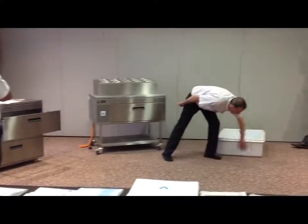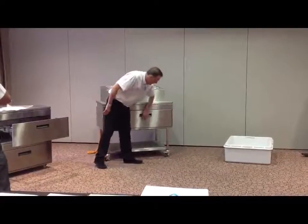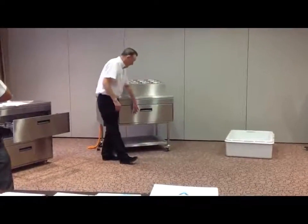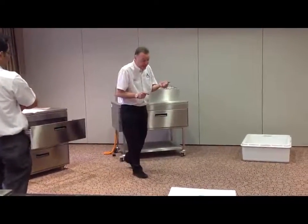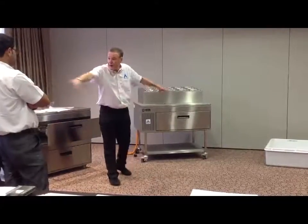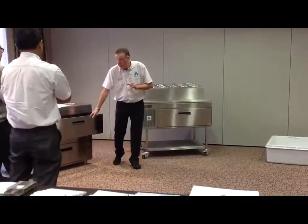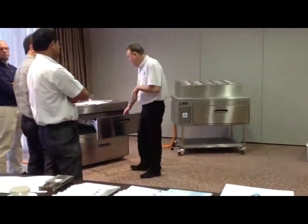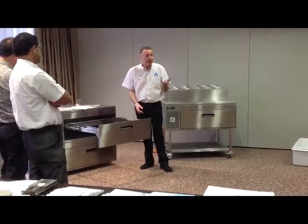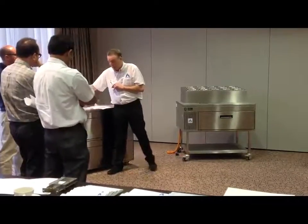We also get some grease just down the sides here. And with the grease, you also get dust and flour and things, and they all stick around these edges. These are your normal screening areas — this is where your normal housekeeping is, to keep these things clean. If you look at the KFC fillet station, for example, they've breaded their chicken fillets on top of and down their unit, so there's flour everywhere. They've got the Henny Penny pressure fryers on this side, so you've got the grease and you've got the flour, and this piece of kit works fantastically in those applications. Every couple of months — perhaps six weeks — they go in with a little paintbrush and brush some of the residual flour off the condenser. We never get any problems with the condensers getting clogged up with grease or fat. Consequently, there's no failure of the compressors. So that's a problem gone.